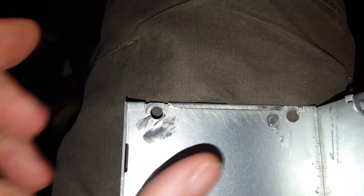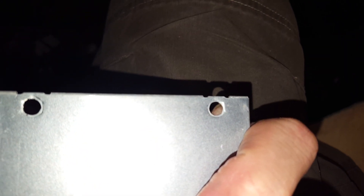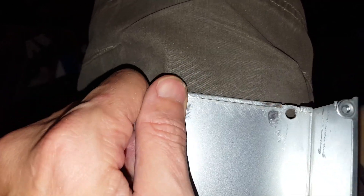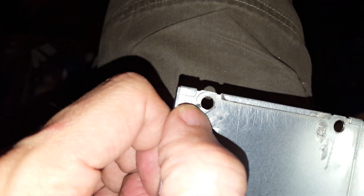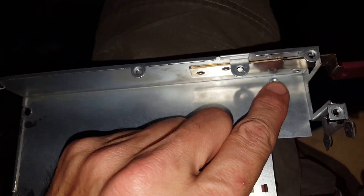We're going to drill this out right through here and that'll pop that piece off, leaving a nice perfectly round circle. Get your drill bit so it's not quite the full size of that little round thing — the standoff — and it'll just heat it up enough so that it pops out without damaging the rest. This is the fifth one I've done; every single one, when I start to drill on the center, the whole thing pops right out. There's a little insert sitting in there — it just pops out. I thought I'd have to drill a full hole through the plate, but I didn't — every one of them just pops right out when drilling.